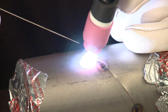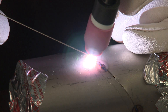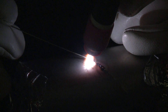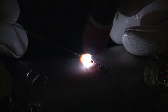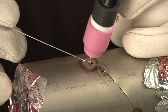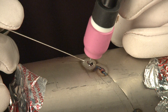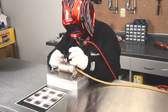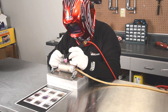I'm going to do an arc initiation — it's pretty thin material, so we're only going to use maybe about 25 amps. This material gets nice and shiny, so I've added filler material. Now I'm backing off and it's post-flowing. I'm letting the argon flow for that full 15 seconds, and when I hear it stop, I'll flip my hood up and take a look at it.